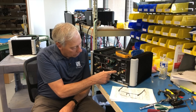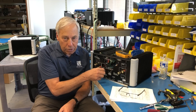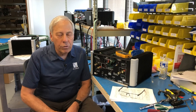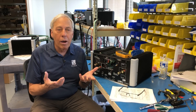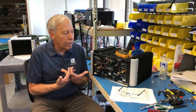Sometimes they had a group of taps — different places, jumpers sometimes — that you could change. That was the output transformer that you were changing. A transformer, as we may remember from our talks, is really just two coils of wire with a whole bunch of iron around it.